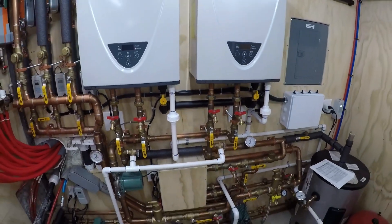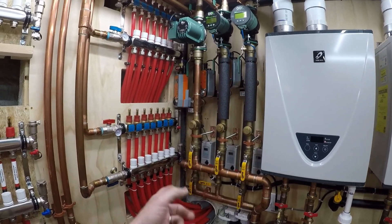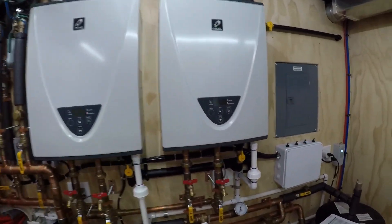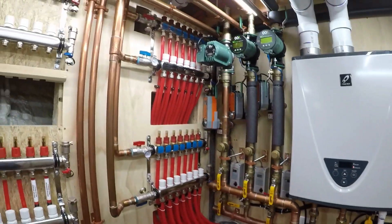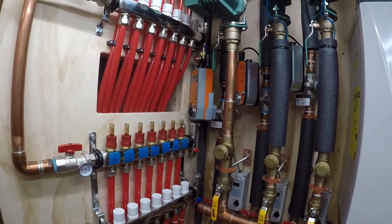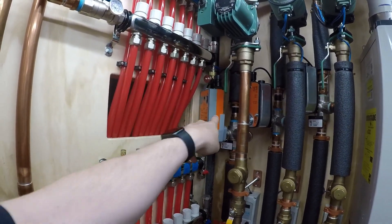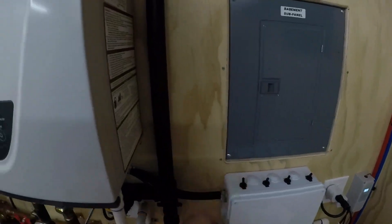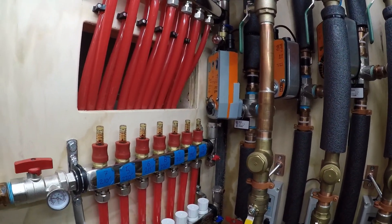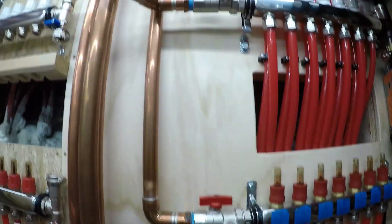The question is: how warm can I get the glycol coming back from a driveway in the sun? To find out, I've disabled the primary pump. Let's turn on the snow melt. Okay, pump's on. Now I'm probably going to have to bypass — this is just bypassing right now. I've got to open this three-way valve, so I'll override that here. So that is now opening.